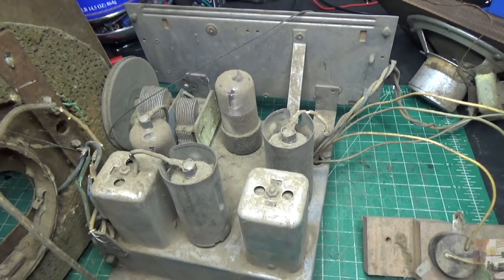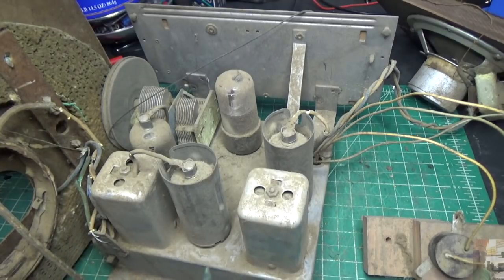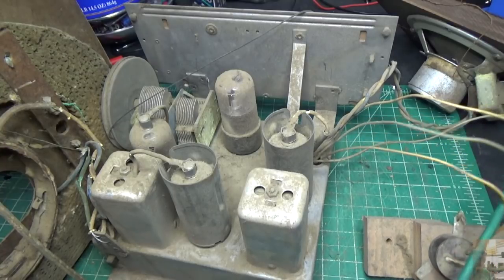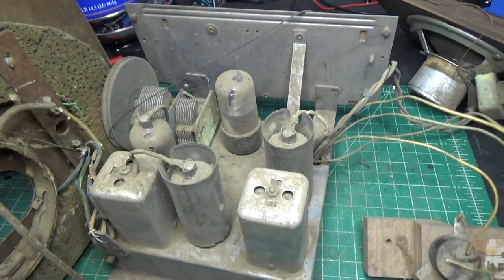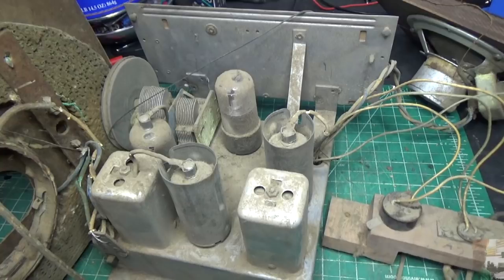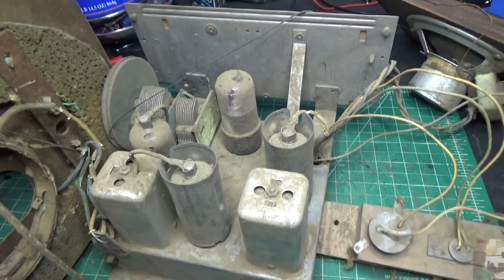If you look at these wires that go to the built-in antenna — which is kind of unique — it looks like they took wire and poured it into a mold with cardboard impregnated in there. There's a lot of dust. We're going to take this out. These wires have green disease, so we're going to replace them. I should then be able to cut the wires for the speaker and carefully mark these wires, because I don't have a schematic so I've got to be careful.